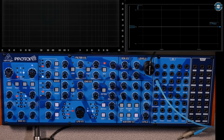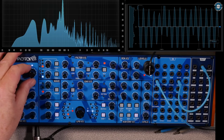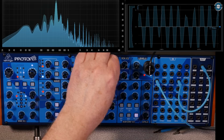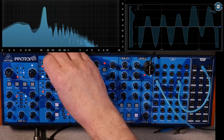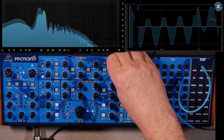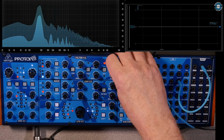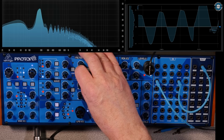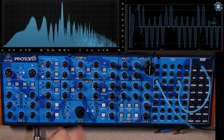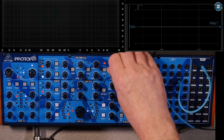Guess what we could do then is we can come out of oscillator 2 output and go into VCF2 in. And sort of use the blend between the two to add. So we're using VCF1 as just a resonant filter, and then oscillator 2 via VCF2. Get like an octave and a half of keyboard tracking, which is a shame, but I guess you can't have everything. This is quite an affordable instrument after all.